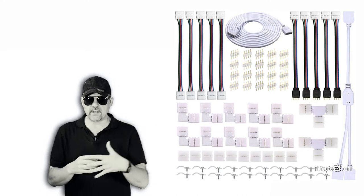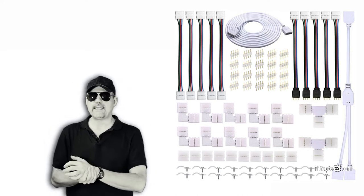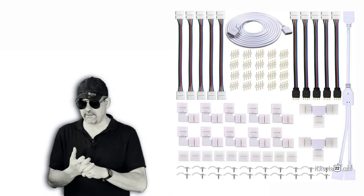You also need to consider whether you need to use metal rails or not, because some LED light strips emit a little more heat and you need aluminum strips to help dissipate the heat, which makes the bulbs last longer and not cause any kind of fire hazard.